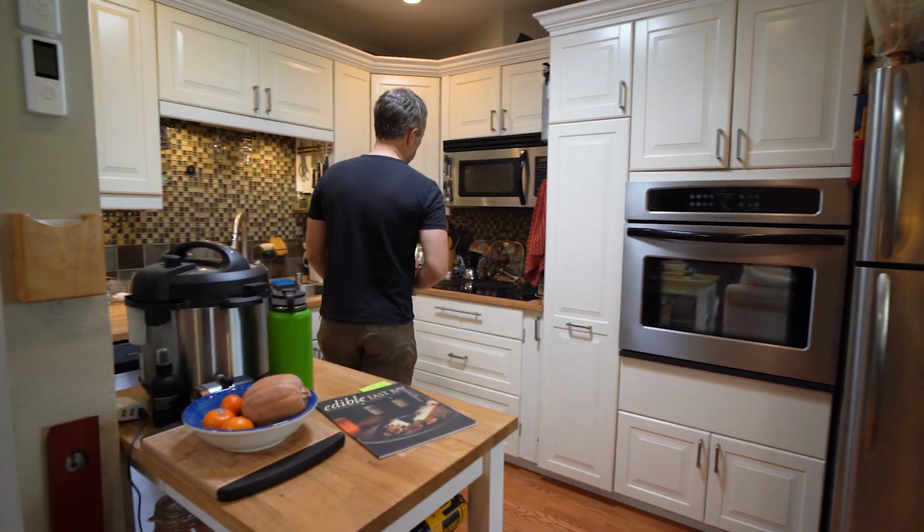or in the apartment. So one of the things that improving your building envelope allows you to do, in addition to making your home more efficient, is you can shift the time that you use the electricity that you've now shifted all of your heating and cooling loads to run it during the middle of the day when solar electricity is abundant. This apartment is now insulated enough that I can run the heat pump almost entirely between 9 a.m. and 3 p.m. and then turn it off, and the apartment will stay warm enough overnight until the next morning.